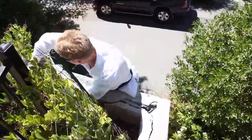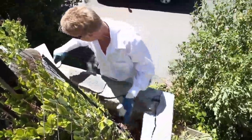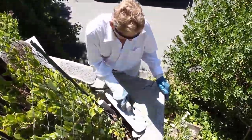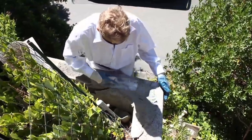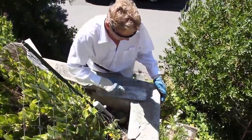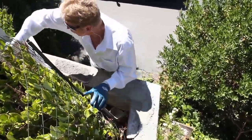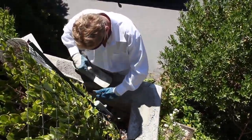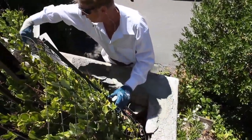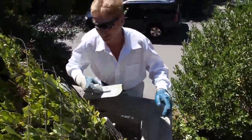Here's how we repair it. I'm using the same cement as we used the first time here. Now, is this going to last forever? No — no way. What I told the homeowner is: this is not stucco's fault; it is the fault of movement. There's no such thing as stucco deteriorating a wall. Stucco is cement plaster — it will not deteriorate a wall and it has nothing to do with the structural strength either. What we're doing here is cosmetic.